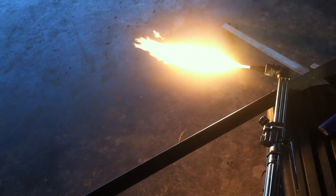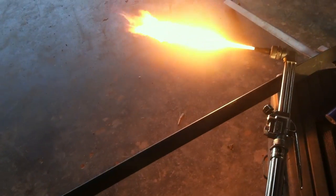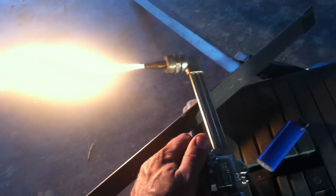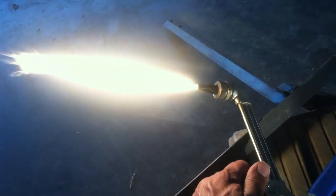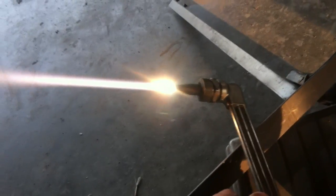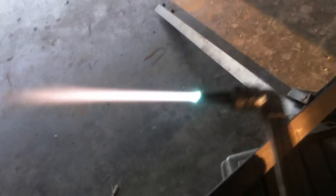Turn it back up — don't turn it up real high like that unless you're cutting something thick — just turn it up to where right when the black smoke goes away, which is right about there. Now I've turned on my oxygen, and I'm going to crank this small knob and that's going to feed the oxygen to it. There's a shiny light in the middle; I'm going to draw it back to where it's just right at the tip. Just got a nice little blue light right at the tip, and that's where you want it.